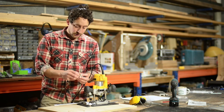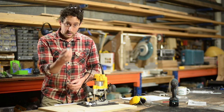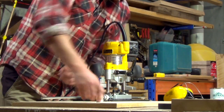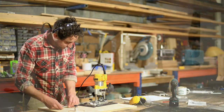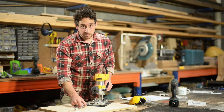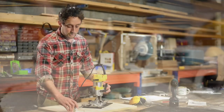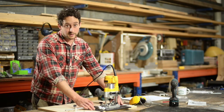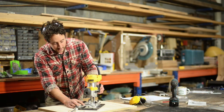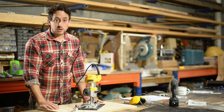To do large circles, you take the brass pin and screw it into a little device that comes with the kit. That device sits in your centre hole, and you use one of the additional rods screwed into the bolt on the end — there's only one bolt that will receive the rod. That rod slides through the device, allowing you to use it like a large trammel or a really large router compass. You tighten that off, slide the router into position, use the micro adjust, and do a nice large arc — in this case not a full circle.